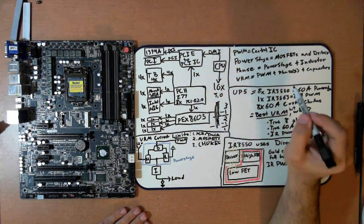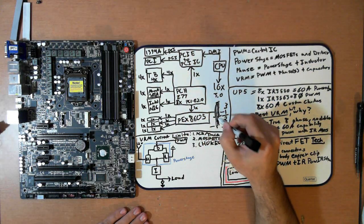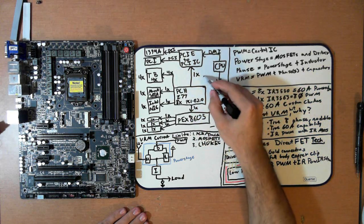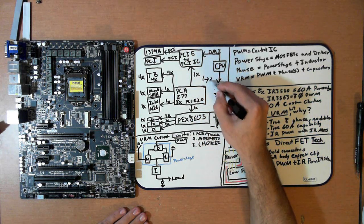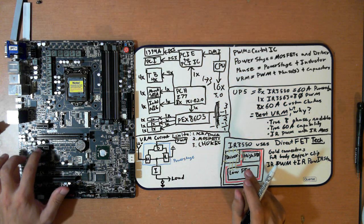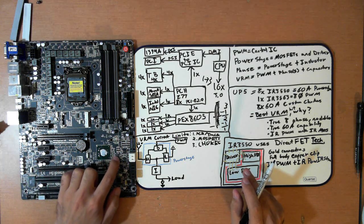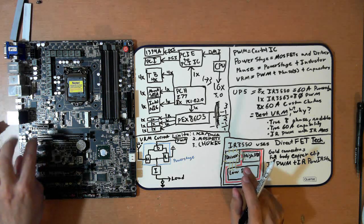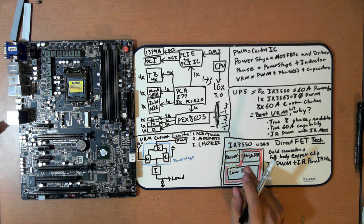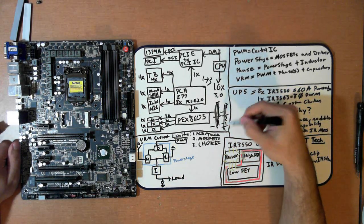So Gigabyte and other manufacturers have to take a step up. Gigabyte's the first one I've seen to use a PX8605. Well, not one of the first, but one of the few. And this is a 3-to-1, so it'll take one lane and turn it into 3. And basically it'll turn into 3 here, so each one of these gets its own lane. Usually these 1x slots use switches like this, or 2.0 switches like this, and they'll switch and they'll train. So you can only use one at a time, or they'll alternate with the last 4x. However, this 4x is connected to the CPU, so that's not an issue. Anyways, that's how that works. So that's how you get all your connectivity.